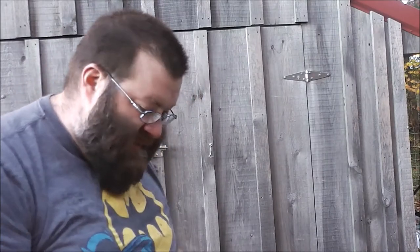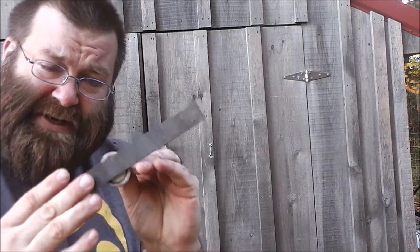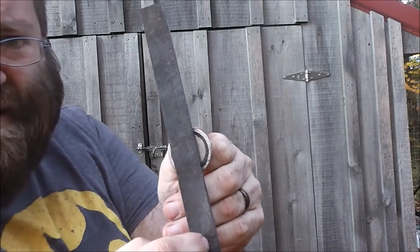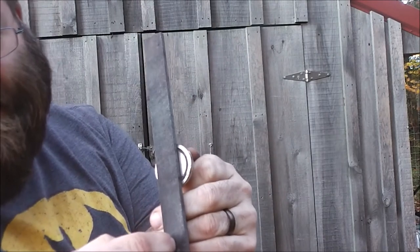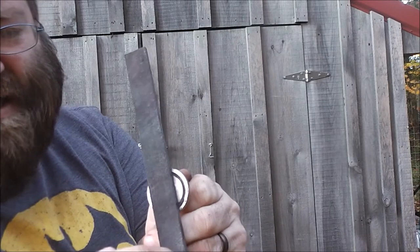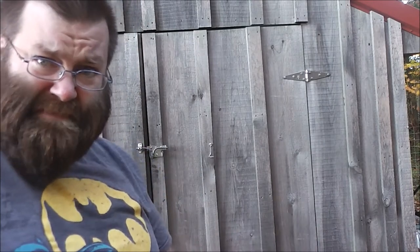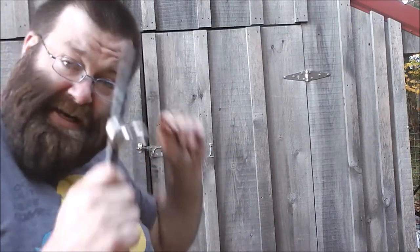What we're going to do is turn on the grinder. I'm just going to grind some of these teeth down, make it a little bit smoother so I can write on it with a pen. Once it's written on, I'll do a cut — probably cut this not quite in half, give myself maybe three-eighths of an inch on the edge and then maybe four or five inches, cut across. Then I'll just hand file in the teeth and it should be good to go. Harden it and get ready to use it.